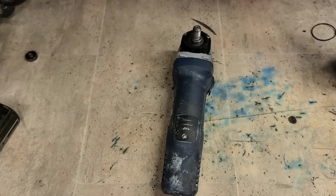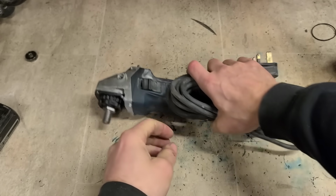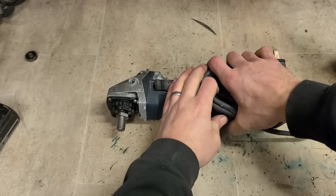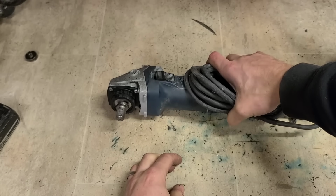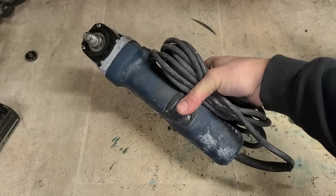Now, a little bit of oil came out of the head. I would imagine it was simply from the wrong grease being used, or else that seal been worn. But that should cure it now. Heavier grease should stop it from coming out, and that bearing changed would hopefully stop this coming in again very shortly whenever it's eventually failed.